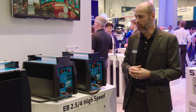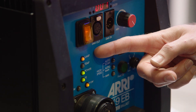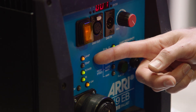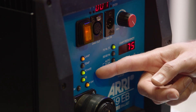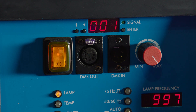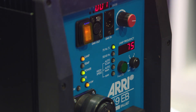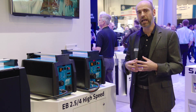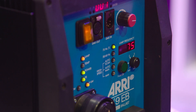In addition we have many standard safety features. We have indicators here — you can see them illuminated — to show what wattage is applied, whether the lamp is on, if there's an over-temperature condition, power, and of course PE. PE means protective earth, which is very important for safety, so the first thing indicated here is always protective earth. Further features are DMX in and out, as you can see here, and what you can do via DMX or manually with this potentiometer is dim the electrical power from 100% down to 50%. I emphasize that it is the electrical power, not the light output — because 50% electrical power ends up in about 40% light output, so there is not a linear behavior.